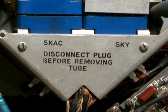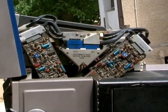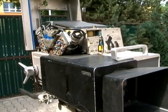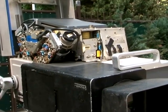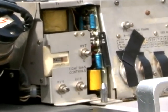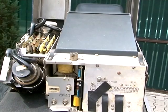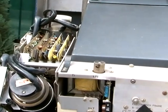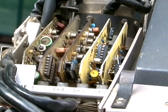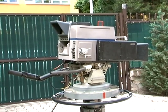Lifting the lid reveals the electronics in the top, and dropping the Q-dome is optional. The green and blue tubes are here. The V-shaped boards are the head amplifier for each of the colours. From the front you can see part of the scanning yoke, and to the right of it the hour meter and the light bias controls. In the top of the camera there are some triangular shaped boards which do the signals for the auto test feature. These inject signals into various parts of the camera video amplifier chain to aid in fault diagnosis.